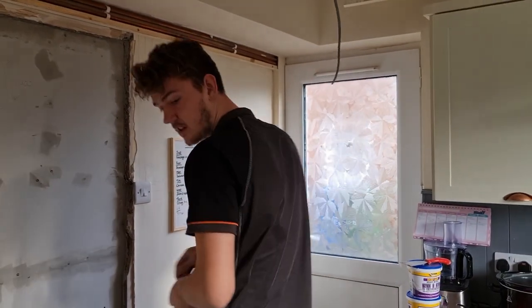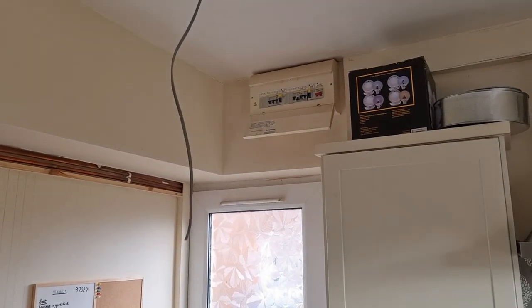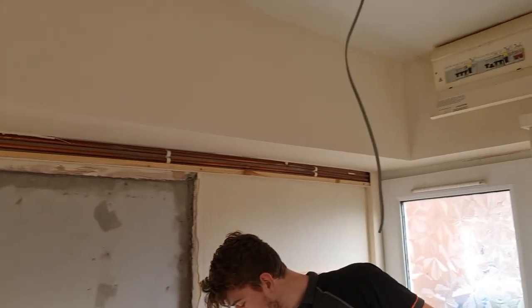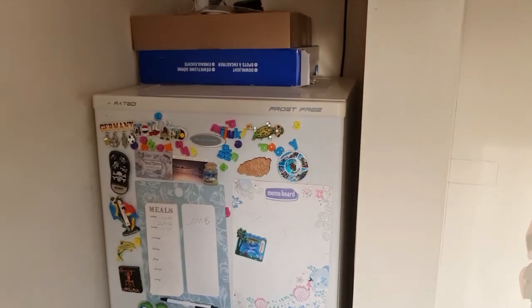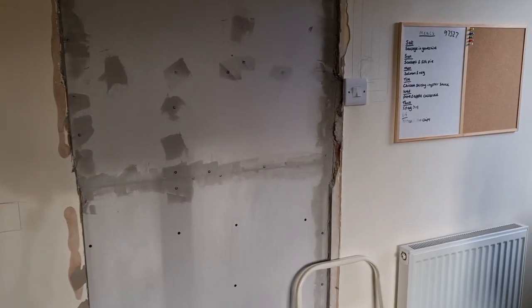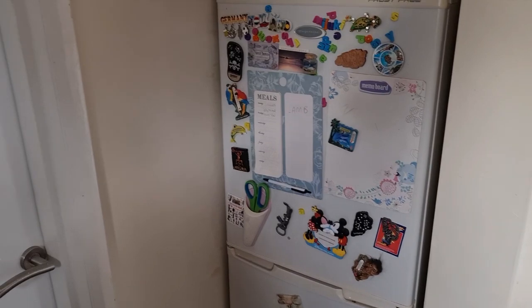Spinning you around — there's Matthew, he's just been sweeping up. At the top there we've got the old Square D split board, and there's this massive bulkhead here. We weren't sure what or why that was there, but it's turned out to be quite handy because we need to get a new 6mm cable across for an oven. The new oven is going to live in this spot where the fridge is at the moment, and next to that it's going to be a big American fridge freezer. There's a socket outlet going where Matthew's marked on the wall, and this light switch is going to be linked across to the other side of the room for the switches that come in from the dining room.